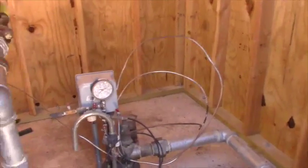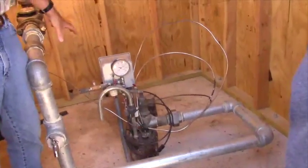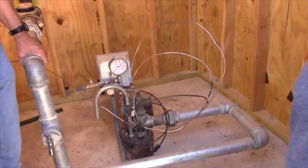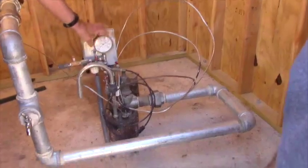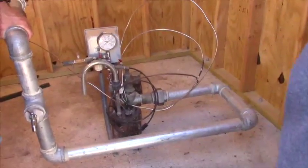No, it uses system pressure. On the input side you'd hook up with nitrogen to flush all the water out of the packer and deflate it so you can pull the pump. This black plastic line is the line for the water level indicator — it also has a gauge on it.